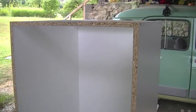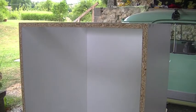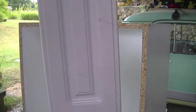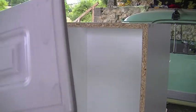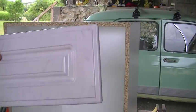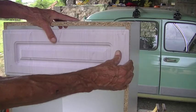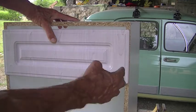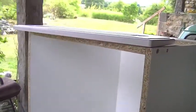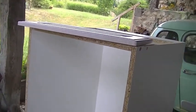The first phase is finished — it's got a back, two sides, a base, and two strips at the top to support the work surface. You're probably wondering how I got to these measurements. I started off with this drawer front which I had bought many years ago — it matches all the ones in our kitchen. I took the measurement of the drawer front and added 2 millimeters on each side. Thank you for watching, and I'll make another video once I get the drawers all measured up and cut.